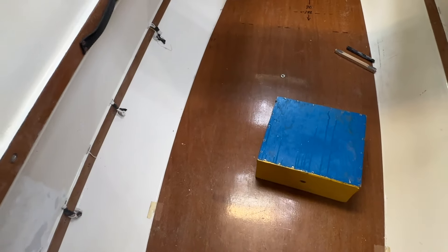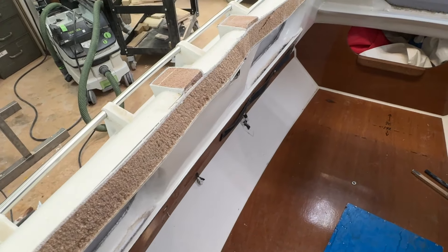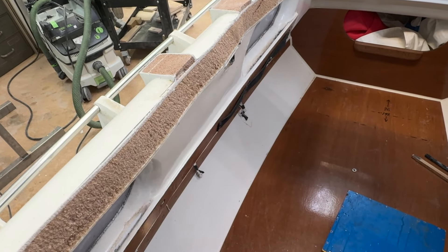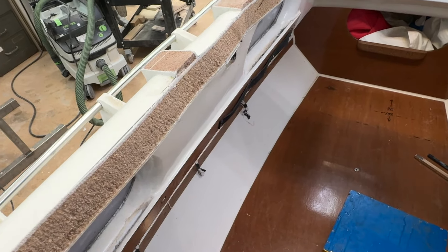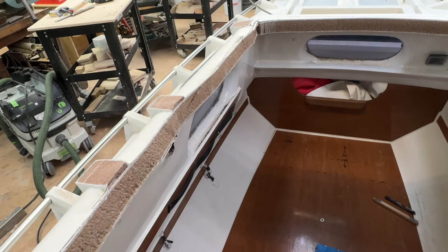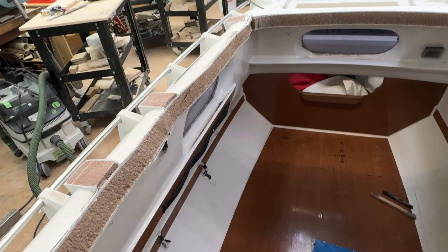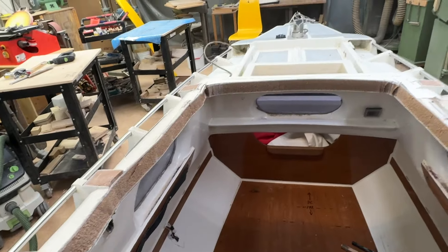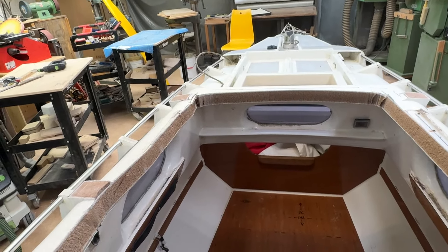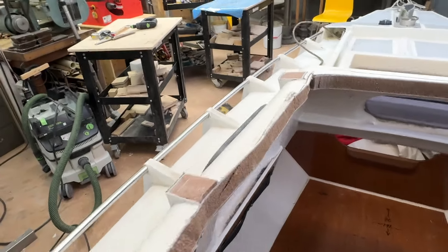It's going to take some time. The deck and the top of the deckhouse are going to be raised about 10 centimeters because I want more flotation up high to give buoyancy when the boat is capsizing. The extra buoyancy combined with the lower center of gravity from the keel and the extra keel weight is going to give plenty of stability.